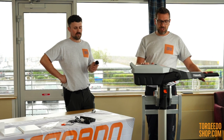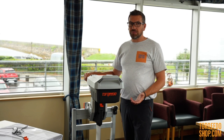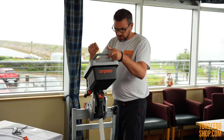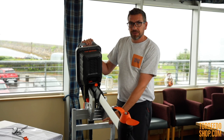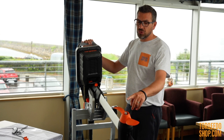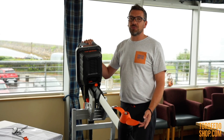That's the battery installed onto the motor. The new motors have the added benefit of bracket anodes — with the motor tilted up, there are anodes on each side of the bracket. They are available as spare parts, sold separately to the prop anode, and in two materials: either aluminium or zinc.